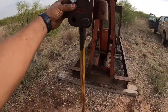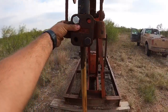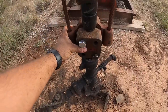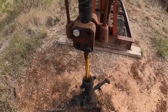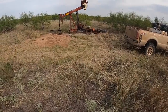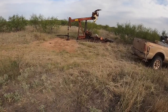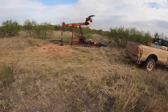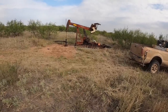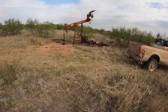It's been down about a minute or two. Now if you can see, that fluid pound is gone — it's right there at the very top with no jar of the fluid. Even if I wait and shut this down in the middle of a stroke where it's moving the fastest, you don't get that hard acceleration. It's a little bit rod heavy, but it's really not that bad.